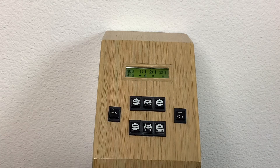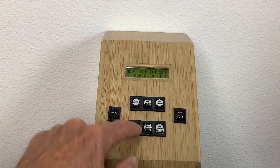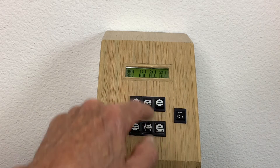The move weights mode automatically moved the weights to their programmed locations. Pressing any pendulum button started the automatic process for that pendulum. The bottom row of the display showed the current distance above or below the target position. In manual adjust mode, the pendulum buttons directly controlled the corresponding servo and its direction.